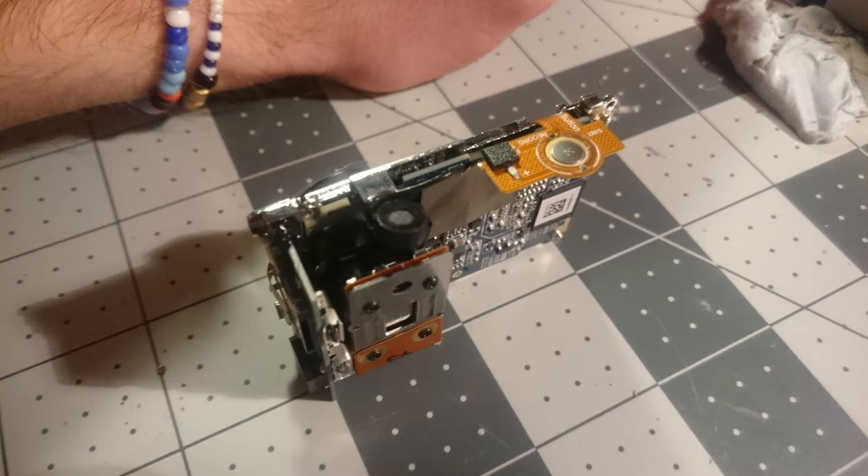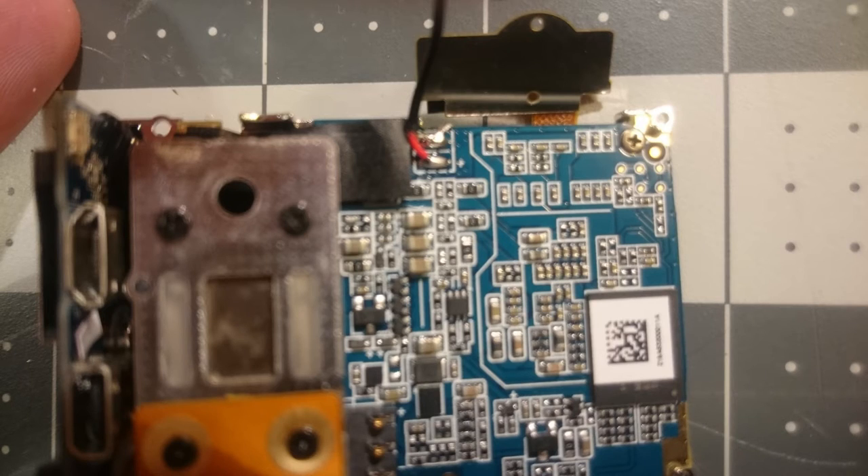Once we take the circuit board out of the camera case, you can see the microphone at the top. We're going to remove that brown tape next to the microphone — that's going to expose the two little solder pads. Sorry about the focus on some of these images; I was just doing this quickly as I did my mod. We're going to de-solder those two pins and remove that microphone off the main board. Keep your soldering iron tip not too hot because these are small pads and you definitely don't want to lift or fry off those pads.